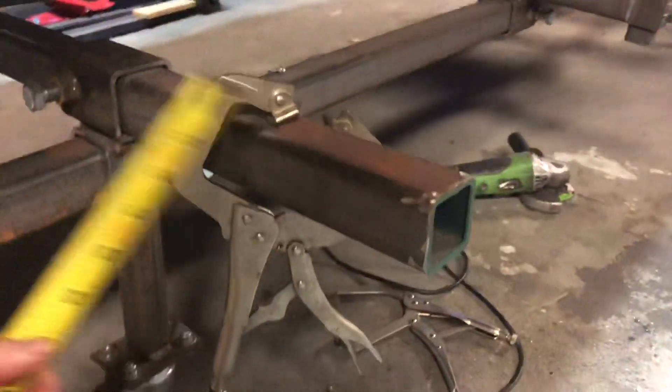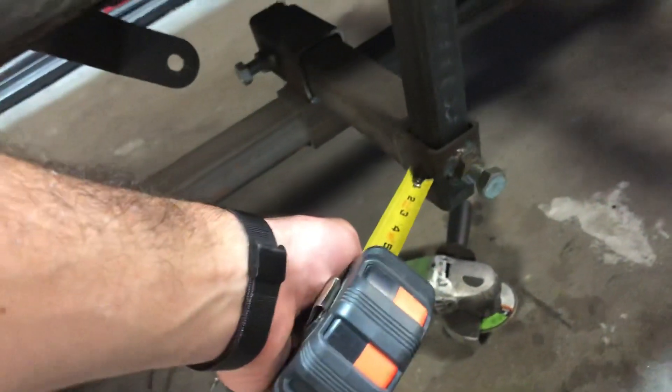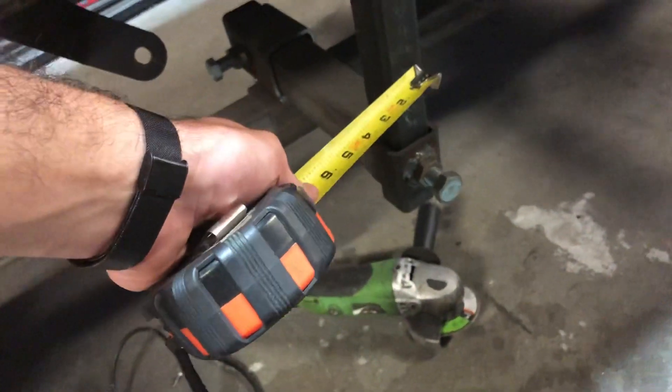These are 2-inch as well because they're the leftovers from the long beams. So the sizing is: 2-and-a-half into a 2-inch female, and inch-and-a-half lifts. The angle iron on top is welded around the arm — it's 2-inch angle iron, probably 3/16ths wall. The top has a plate welded to it with a bolt running through it going into the frame rail. There's a hole drilled on the top and one on the side so it can mount however you need.